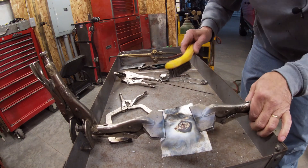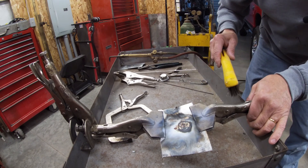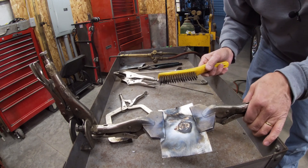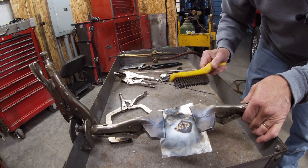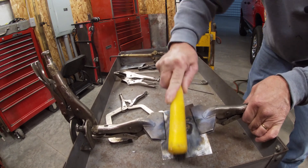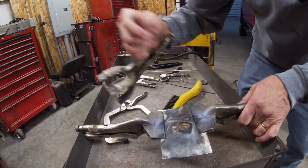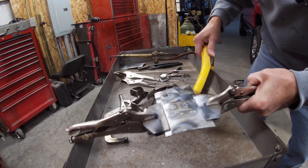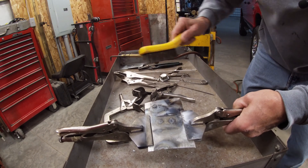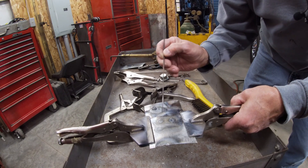That's how we used to do plug welds if we were too lazy to punch our holes ahead of time. It does take quite a bit of heat. Usually you only did that if you were in a spot — you forgot to punch a hole, had it clamped, had some brass in there already, and couldn't take it apart. So it does heat up quite a bit of an area. It's still got a little bit to fill in, but you get the idea. It heats up the back quite a bit — you can see the heat-affected zone is way out to here.